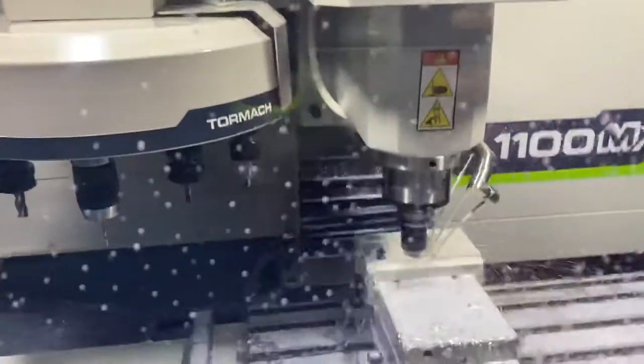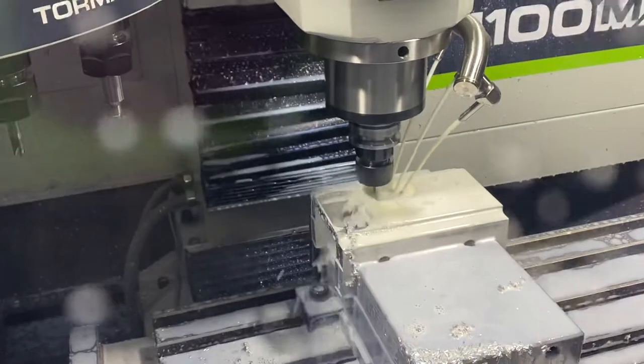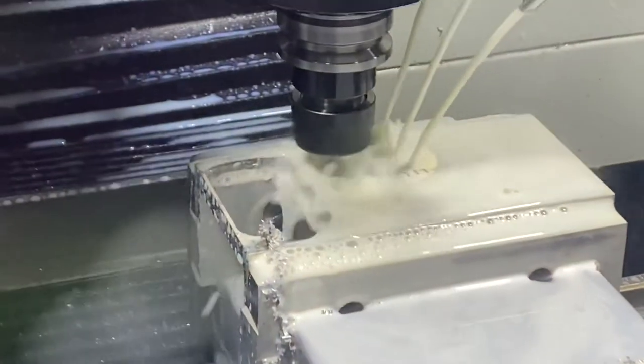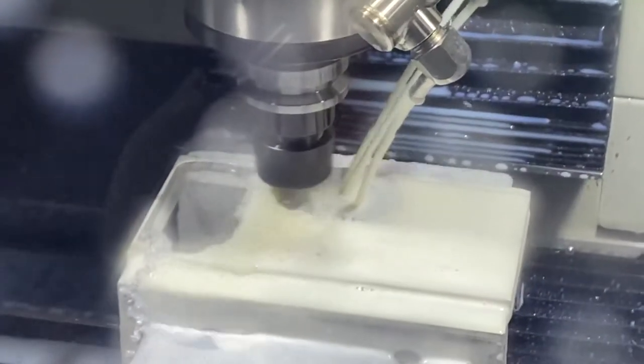So I decided to go ahead and just cut tonight. I don't know what that big chunk of aluminum is doing hanging out there — I'm just a slob. I'm right on the feed rate right now because I'm still working on the path, but it's going to do this pocket real slow because it's a 100% slot cut.